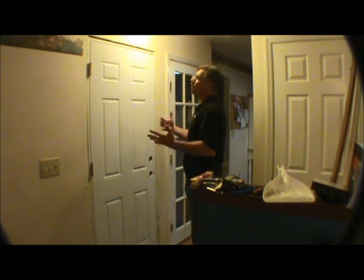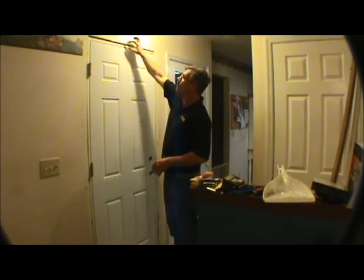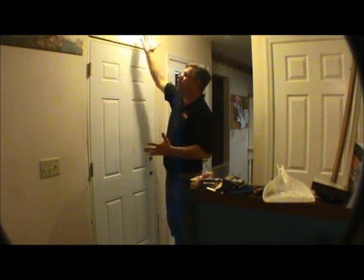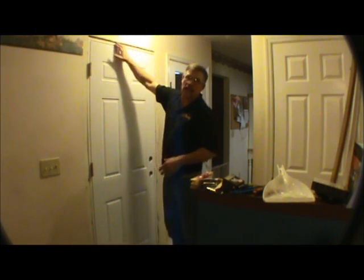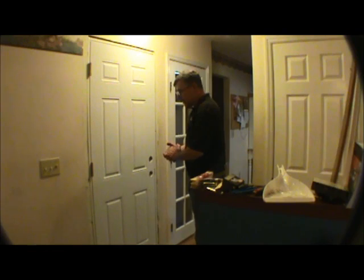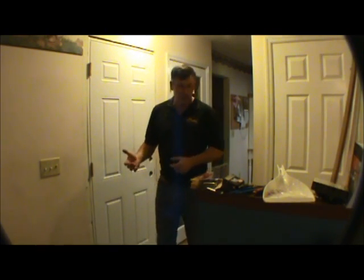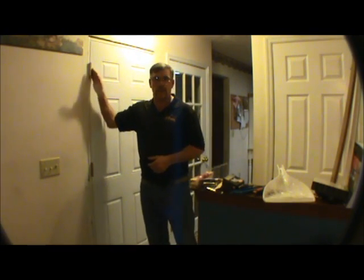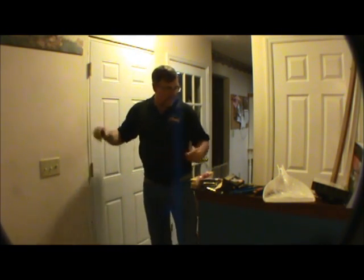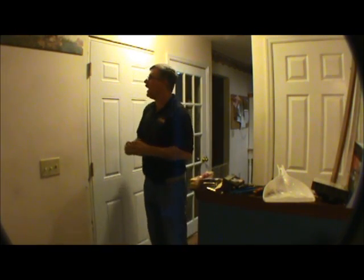Unfortunately, the new door is a little bit larger than the last one, but that's fine. You can see my cut's not so great up at the top edge. Doesn't matter, we still have 1.25 inches of wood trim that's going to cover right over the opening. And having this gap is going to allow me to tuck that insulation back into place as well. Now the other thing, being a fire rated door, they're required to be self-closing, and these came with hinge springs. There's a little pin, and the kit comes with an Allen wrench, and then there's a little pin that goes to that.